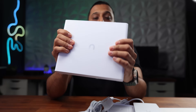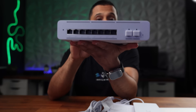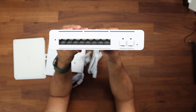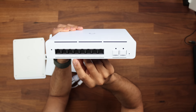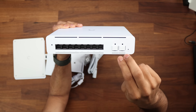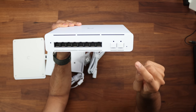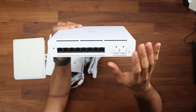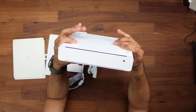This is the first look at the switch itself. At the front it has eight 10-gigabit ports, and if we go a little bit closer you will see that they are PoE++ — you can see the plus-plus signs on them. We also have two 10-gig SFP+ ports, which you can use to uplink to another switch.